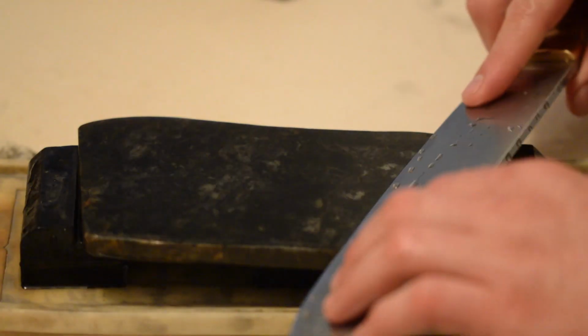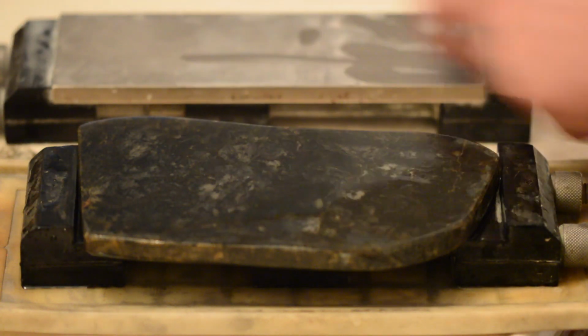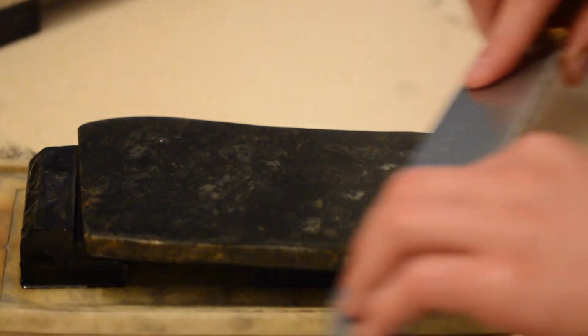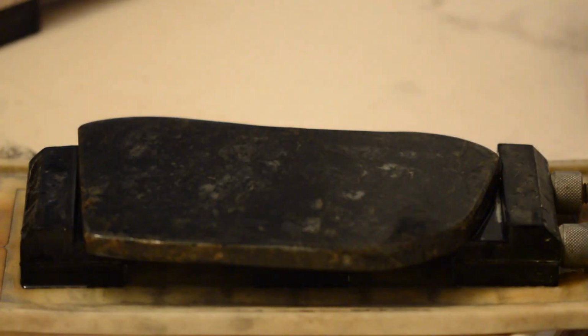So this stone is mostly polished. It's been lapped quite a bit on about a 600 grit. DMT plates wear in really nicely. That was a 325 coarse, but it's gone totally dull. So yeah, just keeping the stone surface pretty smooth, it's still got a really nice cutting action. That sound is all steel coming off.